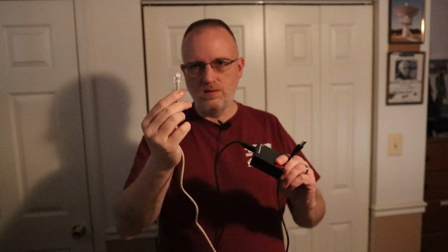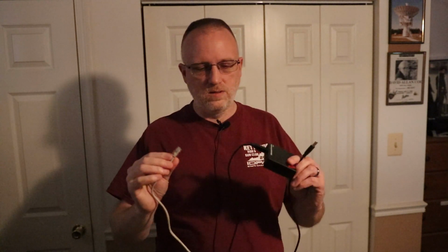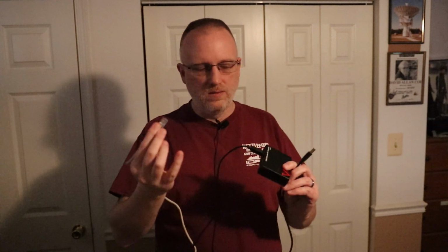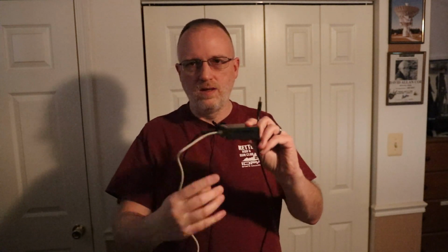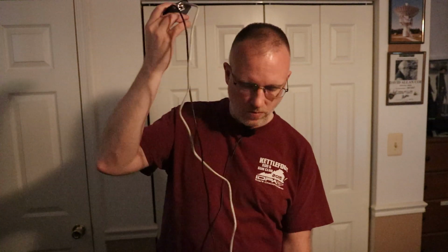With that, we connect a standard Ethernet cable, a Cat5 cable. Cat5 refers to the cabling standard that's used in Ethernet communications, and these guys decided to use standard Ethernet cabling with their own proprietary signaling. So it's not an Ethernet port per se. It's an Ethernet connection as far as the physical connection, but the actual electrical connection, it's not Ethernet. It is proprietary.